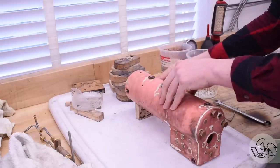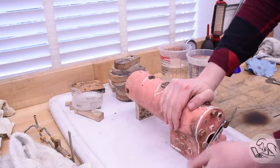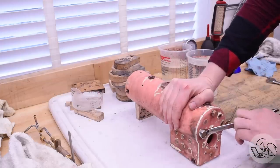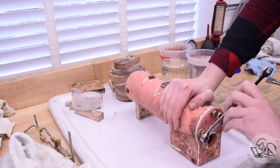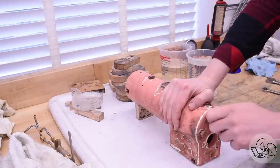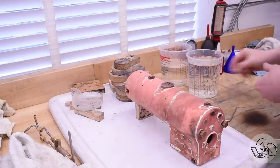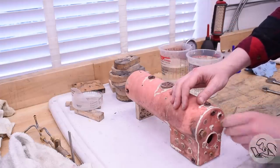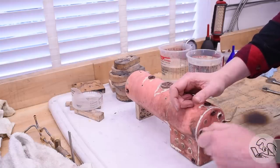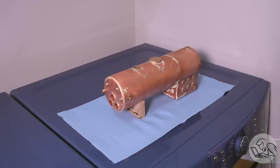You really want to get the feel of silver soldering - learn what a good joint looks like, what a bad joint looks like, understand how to manage the heat, the flux, the pickling, because all those little details are just so important. Locomotives have lots of challenging things to make: valve gear, lubricators, water pumps. But what sets the boiler apart is that it's all or nothing. If you make a mistake on the valve gear just make one or two parts again - you can recover. With the boiler, a hundred percent of it has to be perfect, and if it isn't you have to do it all over again. That's why I made the boiler first.